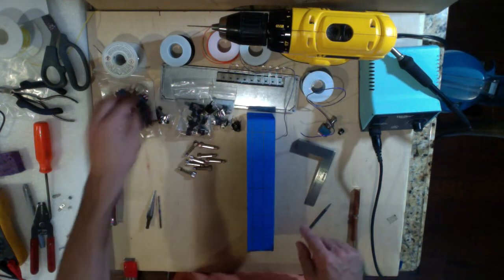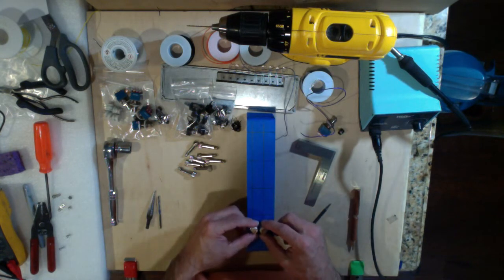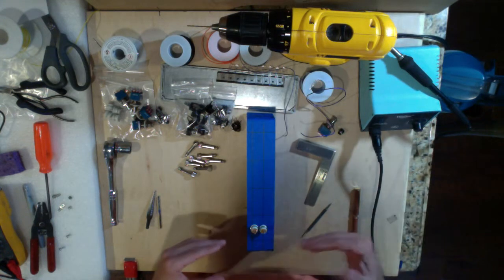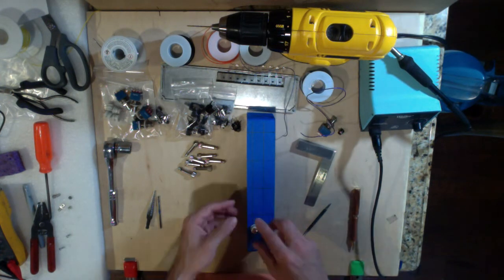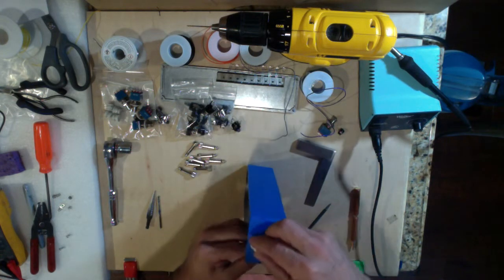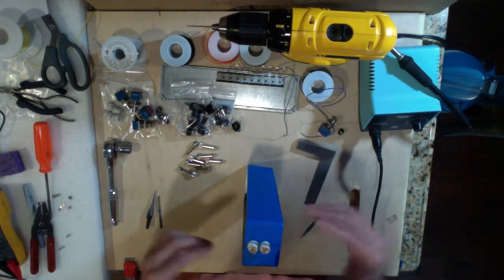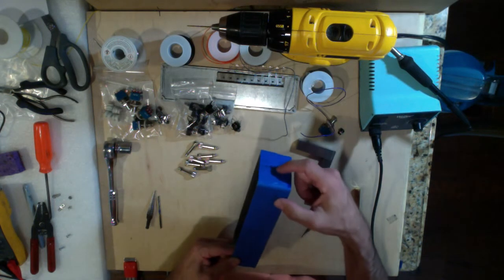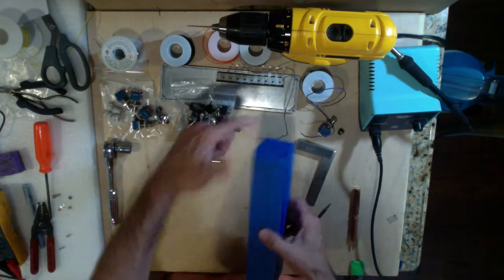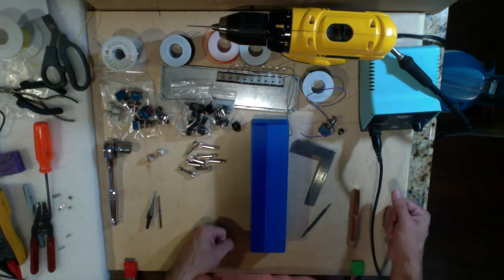So what these are here for is basically DC jacks, using the 2.1 millimeter DC jacks, and I'll have a couple here. And I've mated that with the board to see that there's space here for the jacks to go, and that they made up with channels, and that there's nothing interfering there. So we'll have 2 broken out here, and we'll have on the end here 2 broken out. One of these will be the in, which will supply all of the LEDs that will illuminate which particular loop is active, and then 1 from here will be a breakout, and 2 from here will breakout. So we basically have 1 in, 3 out on the DC, and that'll really help me with the wiring. As most of these pedalboard power supplies, they don't give you a whole lot of 18 volt outputs.